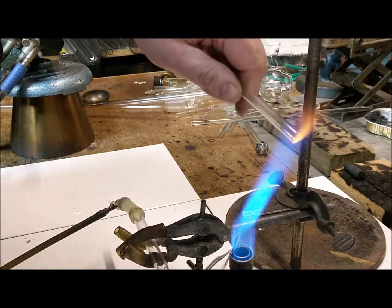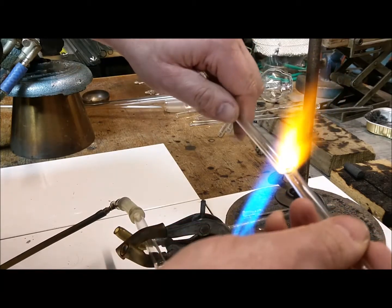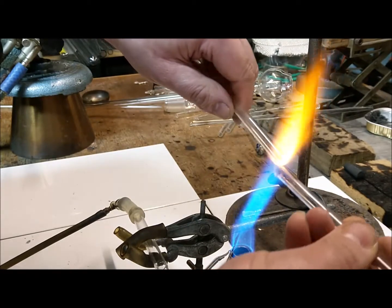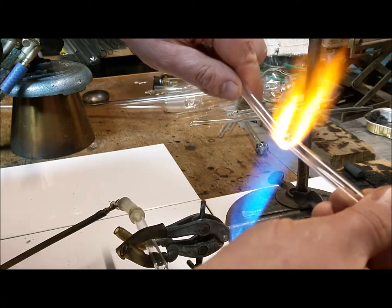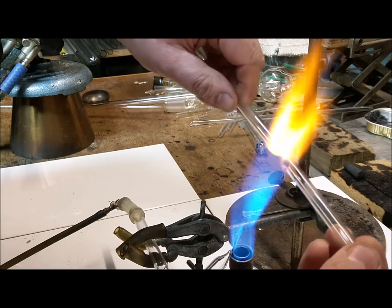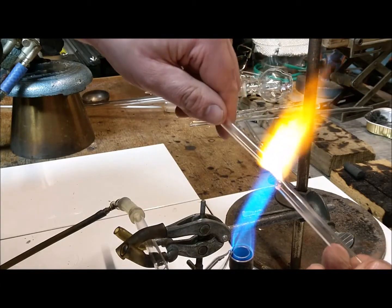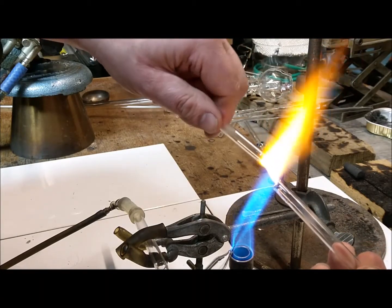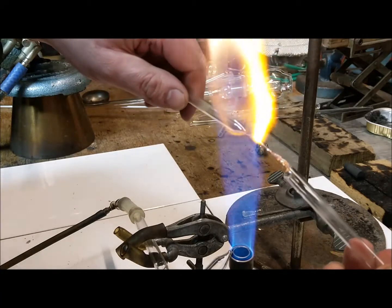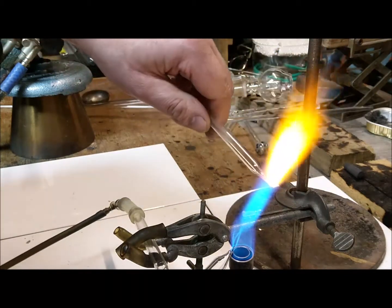To make the base of the ampoule, we're going to use another piece of glass to help form the closure. I'm going to melt the two pieces of glass together with a little bit of pulling and twisting. The glass will melt together and close off the end of that other tube. Now it's going to come to a point — there's a bit of extra glass on the tip than we need, but that's alright. We'll pull that off and melt the two bits of glass back a little more.